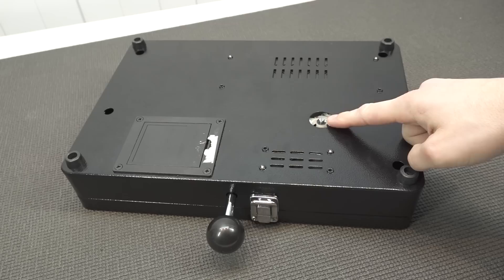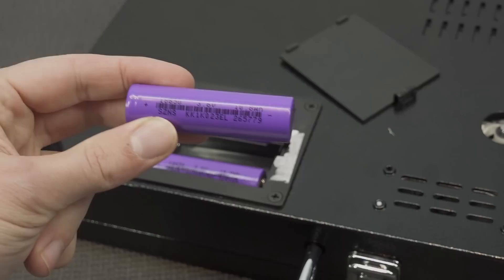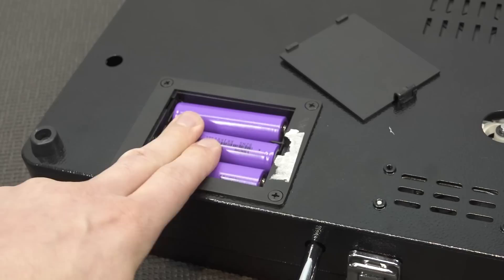At the bottom there is a large hole so you can tighten the joystick assembly with a flat screwdriver. There's also a battery compartment — we can use batteries to make this thing truly portable. They are using 18650 3.6V batteries. Take note there are many different versions, especially regarding the connector. We get three of them, which gives a couple of hours of playtime when fully charged.